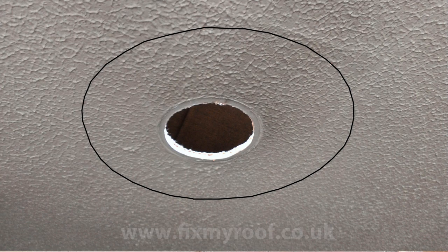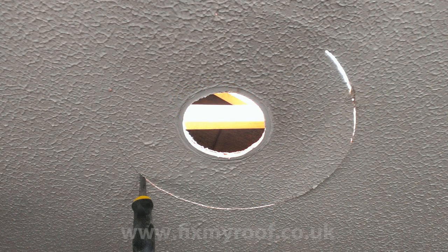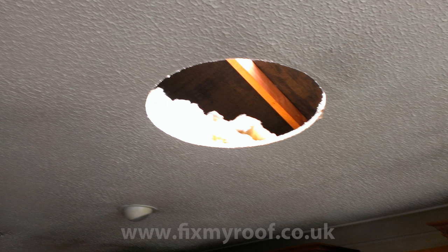Using the template and the drill holes, mark around with a pencil until you are left with a nice clean cutting mark. At this stage I always cut carefully with a manual plasterboard saw just in case there's a hidden wire or pipe that springs back and you can't see it. With a manual plasterboard saw you'll be able to feel it easier than using a power tool — this could save you an expensive mistake.